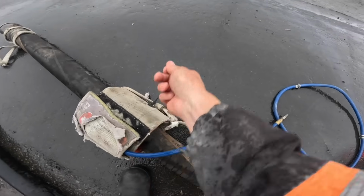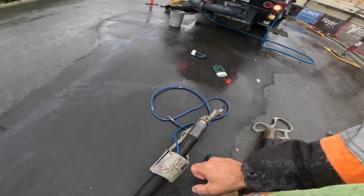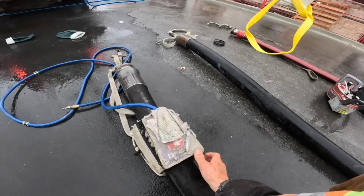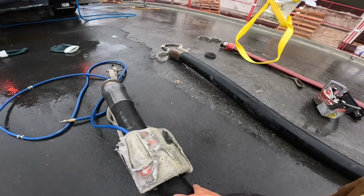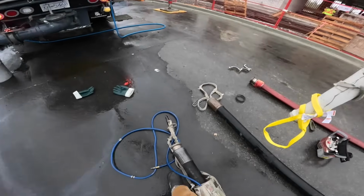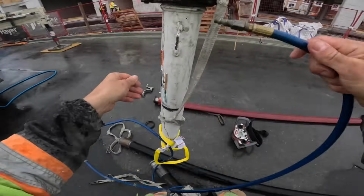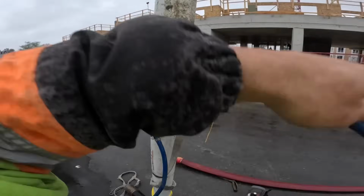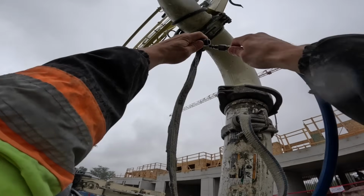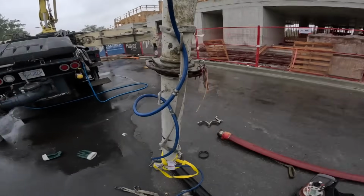This is a smaller conform air cuff. The biggest hose it'll fit around is a 4-inch, but it will cuff off as small as a 2-inch. The standard cuff will fit around a 5-inch, but it only cuffs down to as small as a 3-inch, and we often run 2.5 and 2-inch whip hoses here. So this is the hot ticket for us. There we go, beauty.